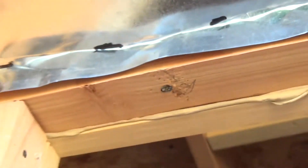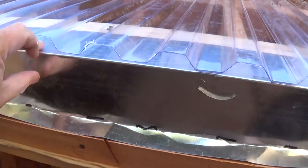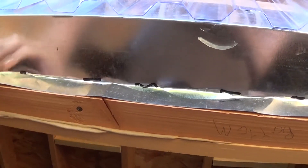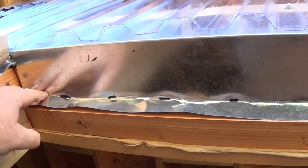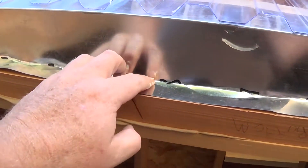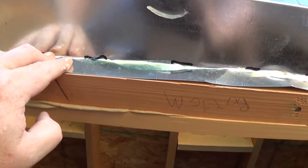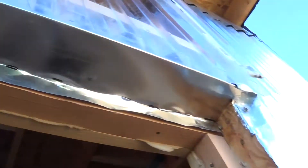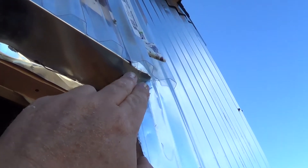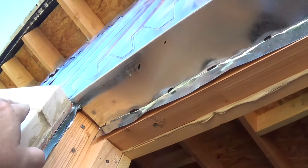That's a two-by-two up there. Then on the top of my door frame I did the same four-by-four edge that I used on the corners. I bent it here so I could close my door, and it goes around to waterproof this edge. It tucks in here and I put some caulking right there, same thing on the other side — tucks in and I put some caulking.